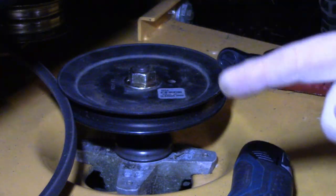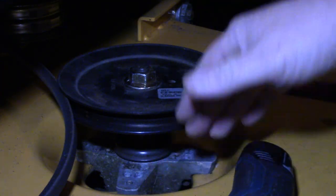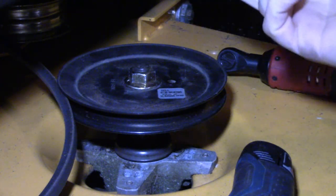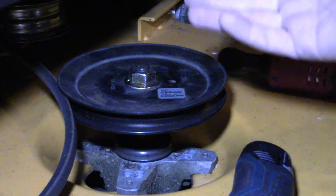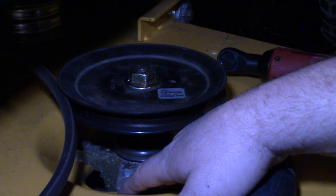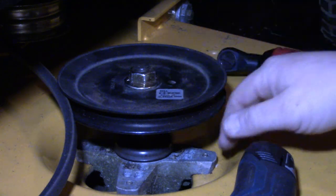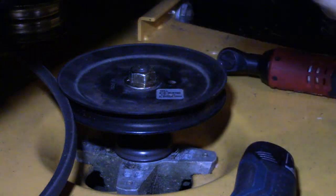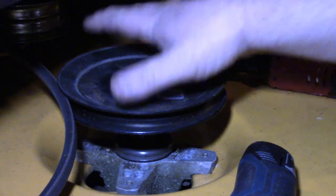When you come across this, you have two options: tear it all the way down — the spindle housing — and keep your fingers crossed that you get the shaft out in one piece, or just get a new spindle and go with it. Personally, it's a lot better to just get a new spindle and throw it in. Normally your spindles will come with a new pulley wheel and everything you need. I'm going to show you a video of replacing it.